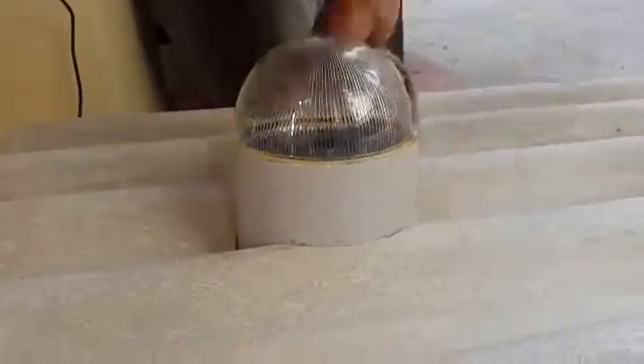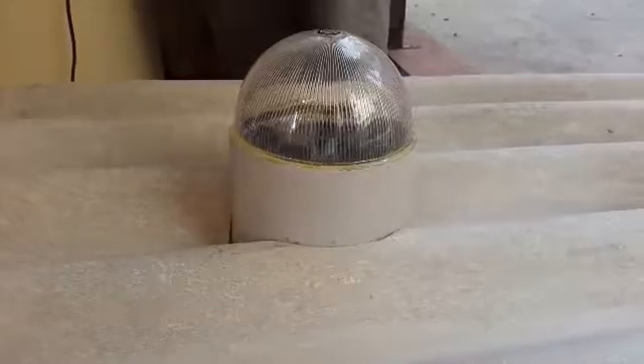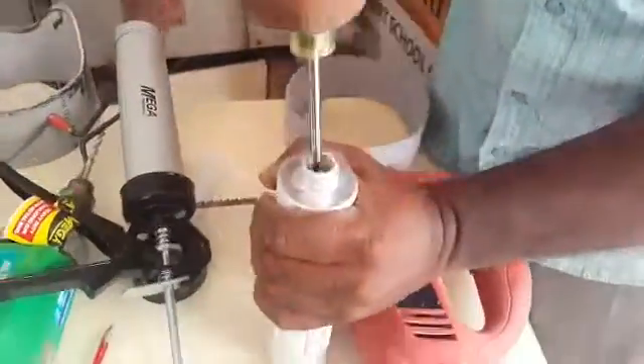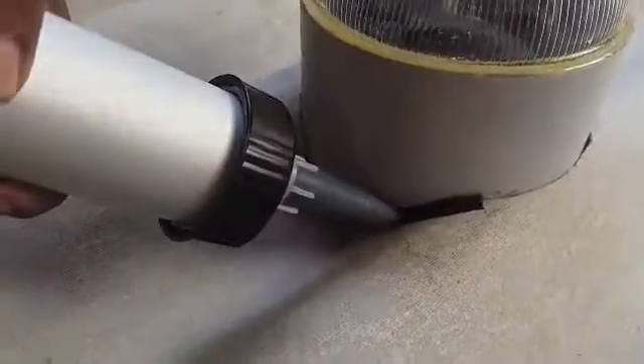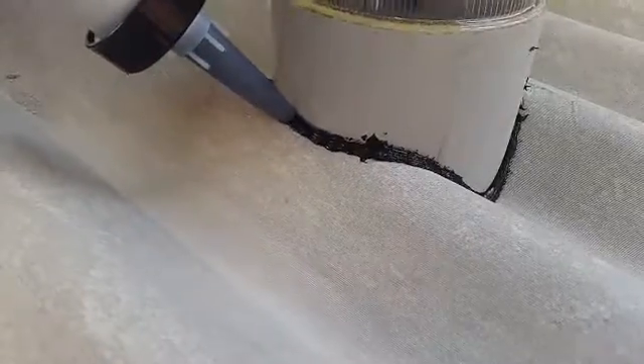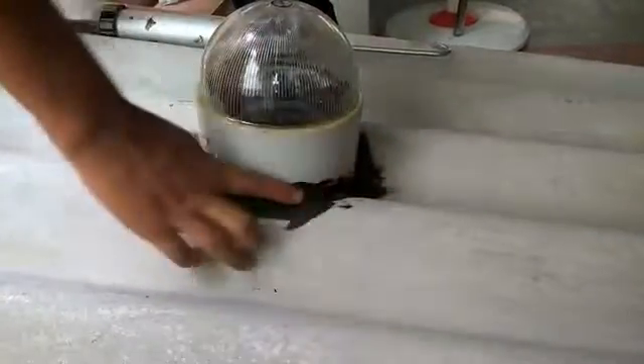The rooftop and the dome are now to be wiped and dusted properly before applying any sealant. A layer of Beta-Seal U-418 sealant is applied with a glue gun on the joint between the PVC pipe and the roof or sheet. Care should be taken that the layer is uniform and seals all gaps. If needed, the layer may be smoothed with the help of fingers.